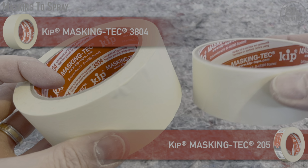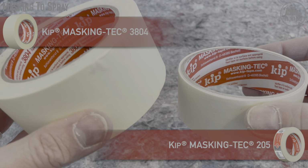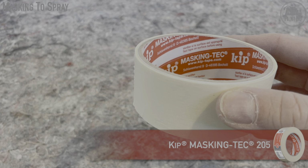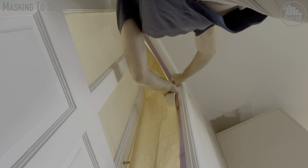I use both these tapes. 3804 is what I use for general tacking down. It has very good adhesion and is cost effective. 205 is a premium crepe tape. You pay a little more, but you can leave it in place for up to 5 days and still remove cleanly.